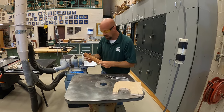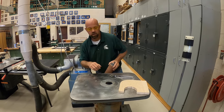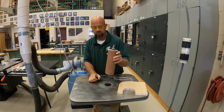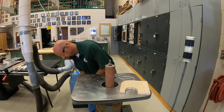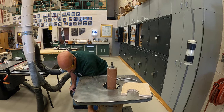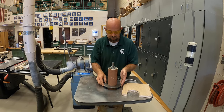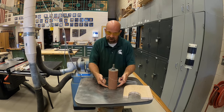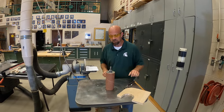I'm going to go ahead and loosen up the spindle portion on the top and pull this out. Now this spindle I'm taking out. As you can see, this throat plate is not going to work, so I need to pull this throat plate out. I'm going to grab the appropriate throat plate for this spindle and place it in there. I only have a little bit of space right here, which is appropriate — this is the right size for this actual spindle.